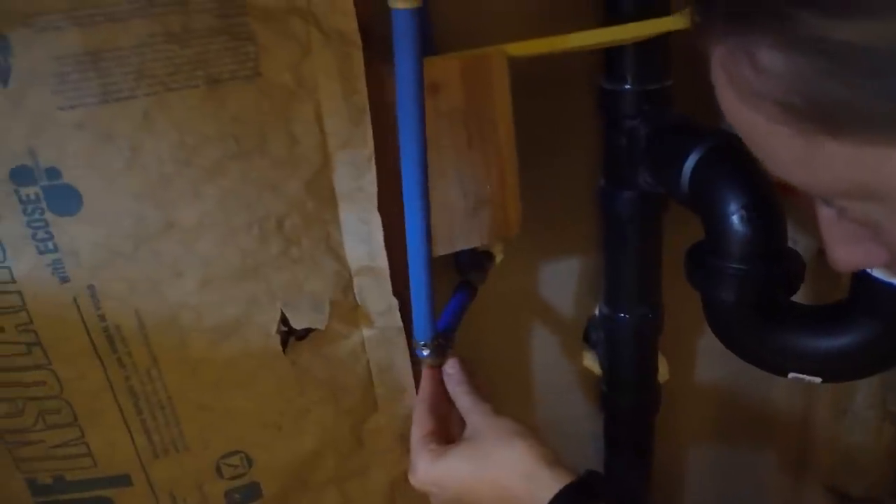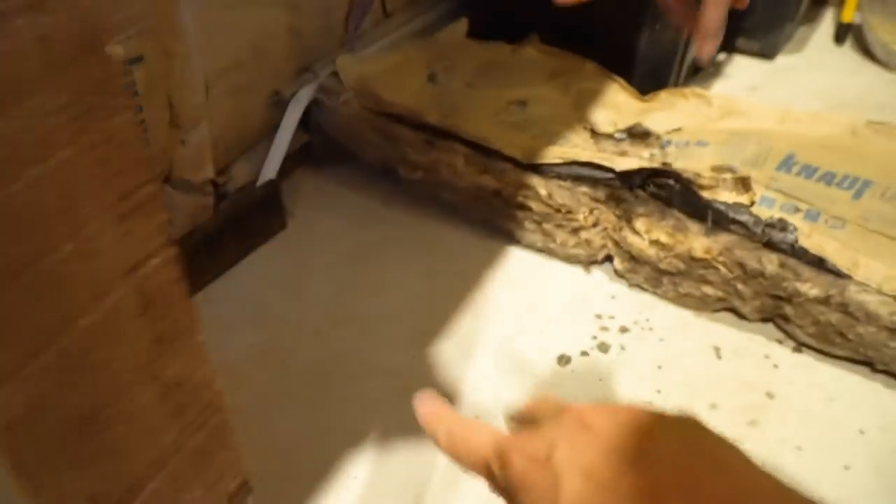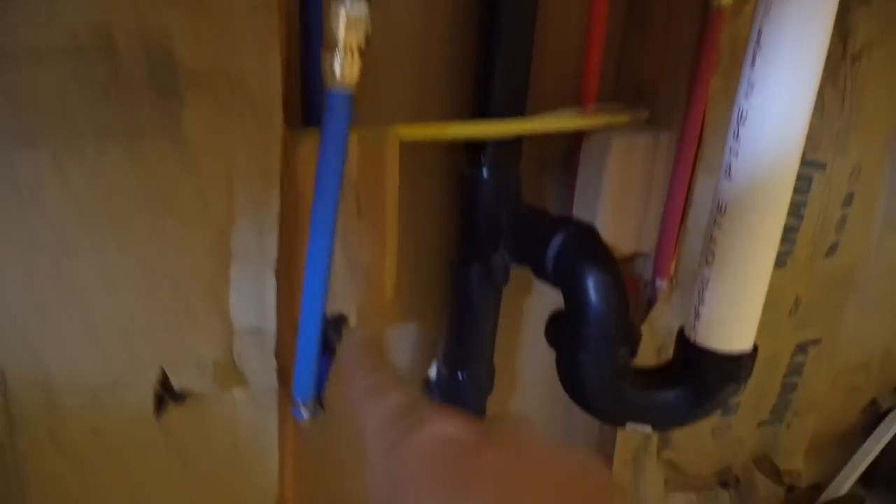It's not wet to me. Down here feels damp but that may just be from before. It was a harrowing experience, but I think we have everything set up. The washer is going to go right there — the drain connects here, comes down into this P-trap and then out and down. We have our cold and hot water hookups from what the previous owner had already put in, running both up like this. We'll bring them over and connect them here, then secure the pipes in place with clamps. Next step: washing machine.